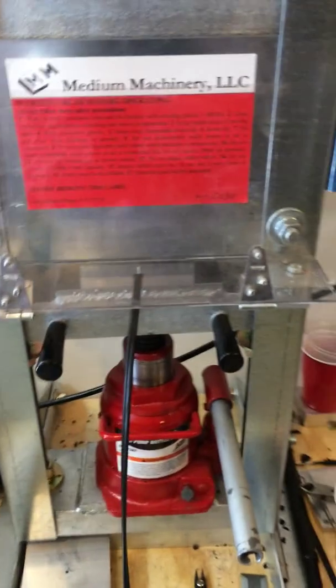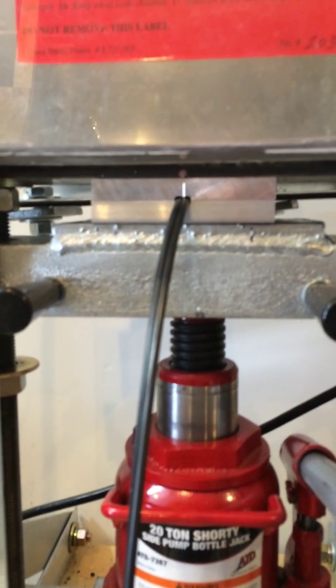That's a nice feature. I thought originally I would end up creating some side guides as well, but I found out I didn't really need that. I did determine where the center of the injection is — I used fingernail polish to basically mark it. One of the features of the molds I make is that it's also got a center guide on it, so I can get this in here, line that up, and then start running the clamp jack and tighten this up a little bit.